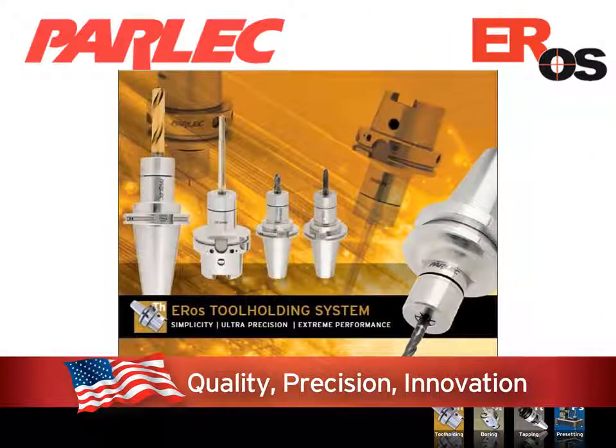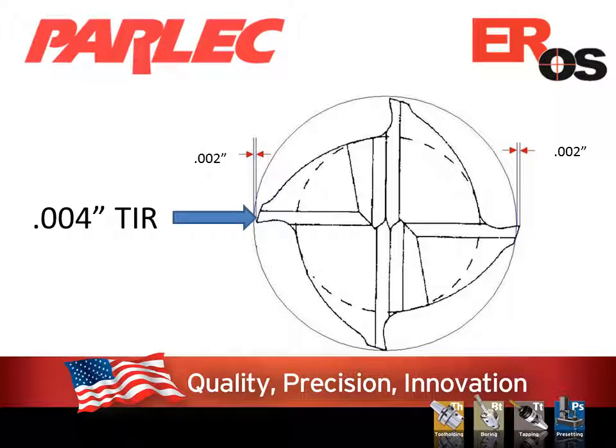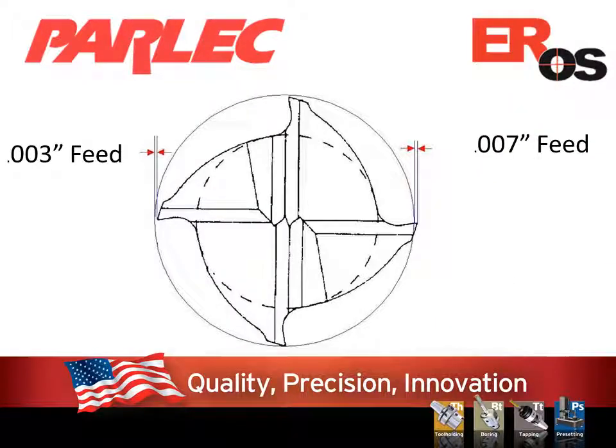Now that you're using ERos in your shop, take advantage of the high feed rate without making any other changes. Let me explain. With a traditional holding device, you typically have between 2 and 4 thousandths runout at your cutting tip. Let's look at a 4-flute cutter programmed to run at 5 thousandths chip load. The highest cutter is taking 7, and the lowest one is taking 3. That means the resulting performance is actually what it takes to do the 7, but your overall production is only at the planned 5. With the ERos, your cutter will run 3 microns at 3 times diameter. Almost no runout at all. So go ahead and up your feed rate to the 7 and get the benefit of the faster production time.